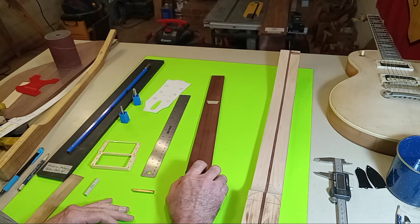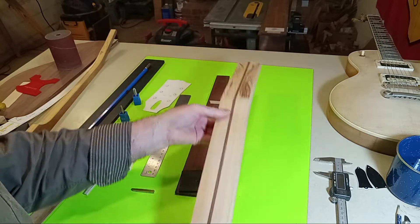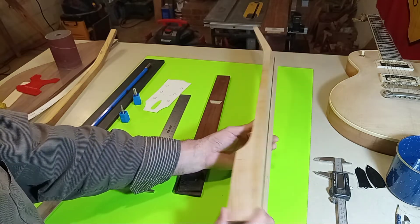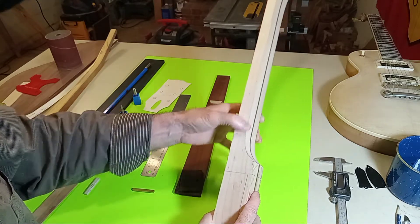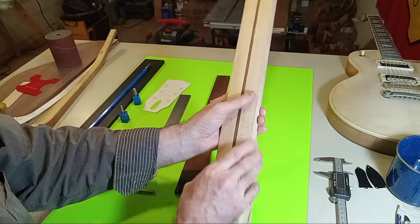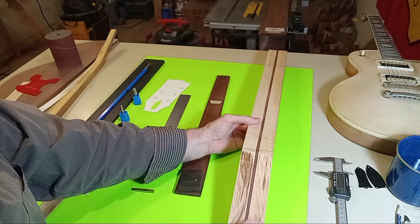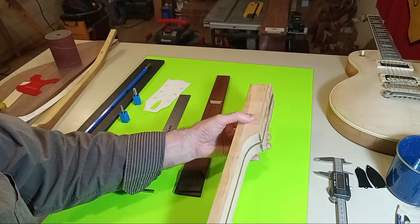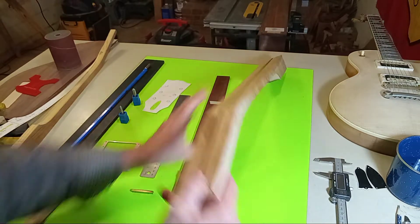I'm not going to talk about the truss rod channel because it'll be easier to just cut it and show you. Order of operations: pull it out of the clamps, verify it's nice and true, then get that taper — that would be the second operation. Once you get the taper, worry about cleaning up the heel. Then put it on the table saw and clean up the points down there.